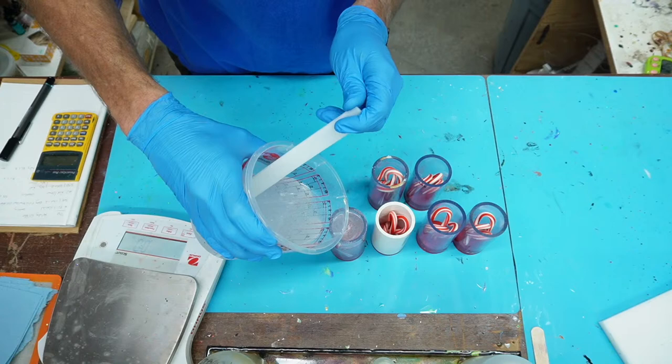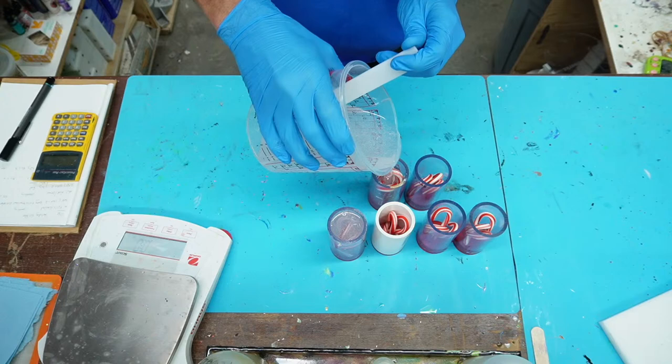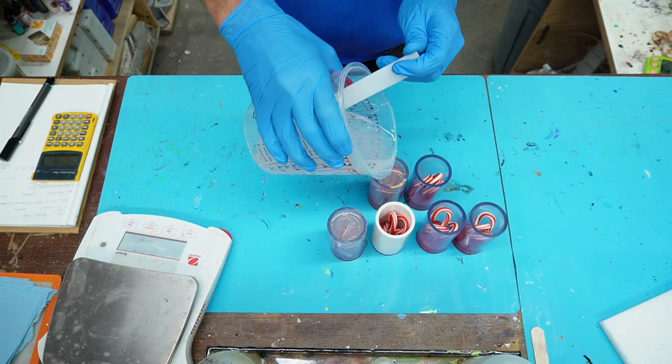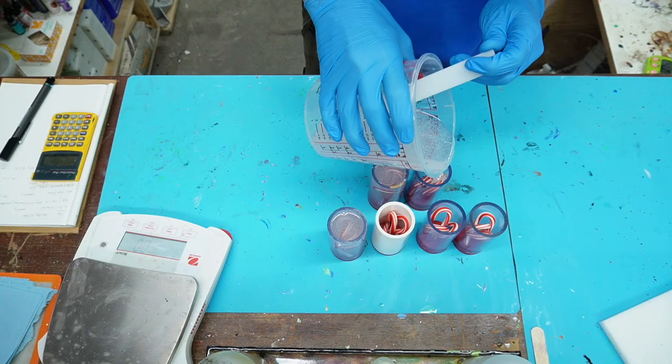And frankly, in some cases, you may want to pour something that was just clear, or maybe just one color, right away, as long as there's no chance of color bleed or any of that stuff. If you're pouring it into something where there's a lot of little crevices, it's a better idea to pour it earlier when it's thinner viscosity, rather than at the end of the working time when it's thick, so that it'll easily flow in and around everything if you've got some kind of weird wood chunks or something going on.